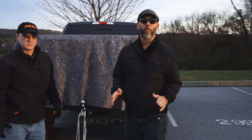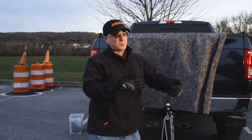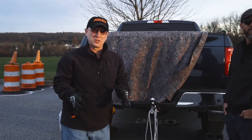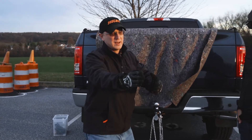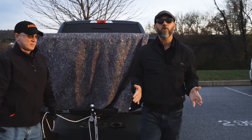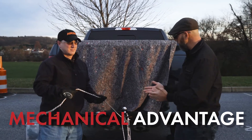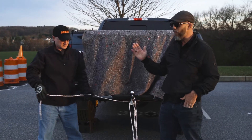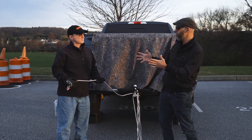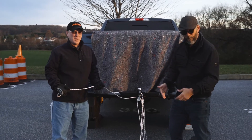Our tug-of-war device is gonna work by changing both the size and the direction of the force. Unlike a normal tug-of-war which is just back and forth, this tug-of-war machine changes the direction of our force — somebody's gonna be pulling that way and then someone else is gonna be pulling almost perpendicular to that other person's motion. These pulleys are also going to give at least one of us a mechanical advantage of two, and I believe it's Mr. Graham. As he pulls his rope that direction, his mechanical advantage is two, which basically means you have to exert almost half the force — half the amount of force that I do.